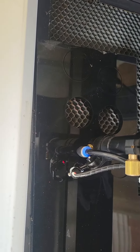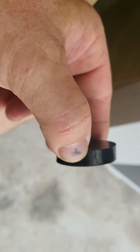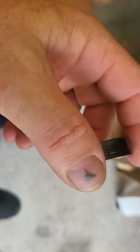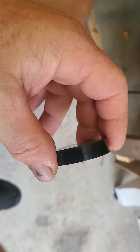So if you can see this, this is the one cut at five mils a second — the bottom edge isn't as clean. Now this is the one that was cut twice, and you can see that edge is a lot smoother.